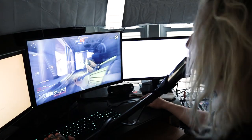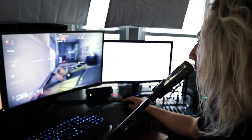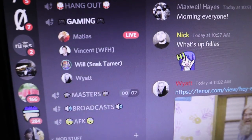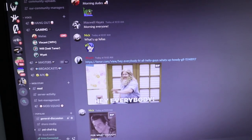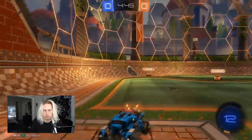Taking that further — and I know this is extreme overkill — I've been using this microphone on Discord while gaming with my speakers on the desk running game audio. Normally that would cause the people I'm talking to to hear themselves as an echo and also hear my game sounds. But with this mic, they only hear my voice, because the speakers are at the 180-degree rejection point of the cardioid pattern and aren't picked up by the capsule. This is especially useful for streamers: the microphone above the desk will reject keyboard noise while keeping your voice clear.